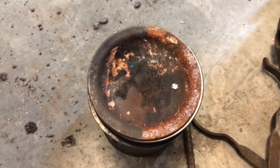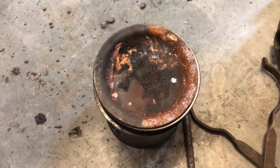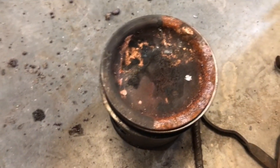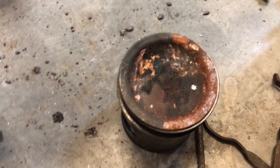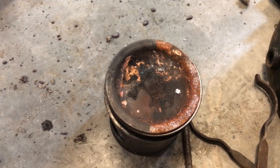But it seems copper is quite a bit hotter and it reacts completely different. I think what happened is the rust holds the moisture in — so lesson learned: the next molds we use need to be completely clean with no rust.